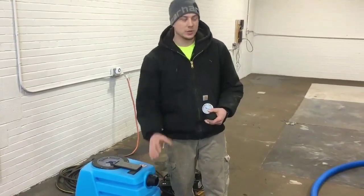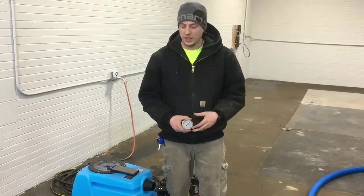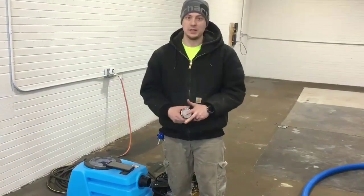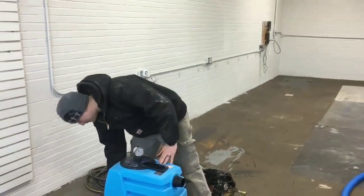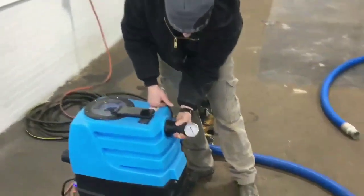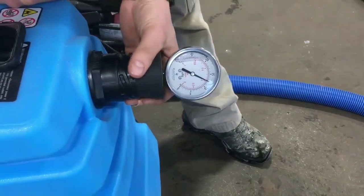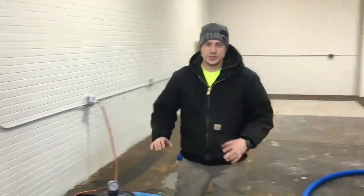We're going to insert the gauge here on the machine, then go to 50 feet, 100 feet, 150 feet, and end at 200 feet. After that, we'll chat a bit more about setup. Basically, what we have here can perform the same as my gas-fired Sapphire truck mount. You notice right at the machine we're just over 12 inches of mercury — about the same as the Sapphire truck mount in the other room connected right to the machine.